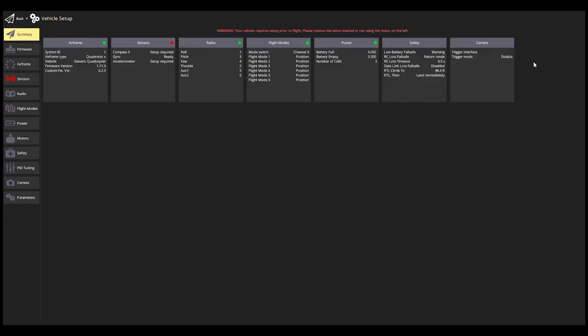I am back at my vehicle setup menu. I went through and set all the flight modes to position mode. That's what I'll be using for my initial flights. The only remaining red circle is sensors. I'll be calibrating all the sensors after I fully assemble the frame prior to my first flight. That'll be my next video.